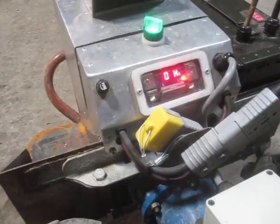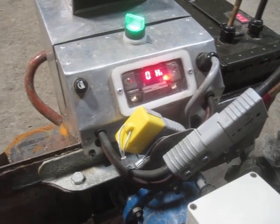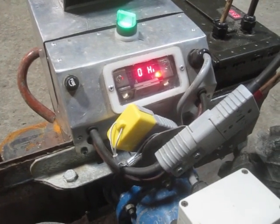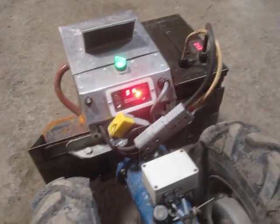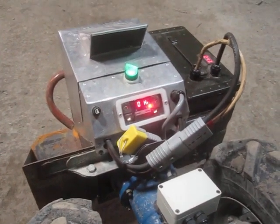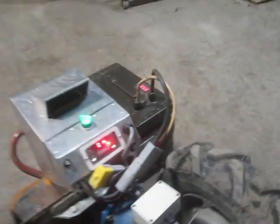When it pegs over 200 amps both sides just say 'HI.' But in first gear it only draws 60 amps rototilling. It's interesting that gearing down means at the much shorter gear ratio it draws a lot less current because the torque demand is that much lower. It's neat to have the instantaneous feedback even though it flutters a bit.